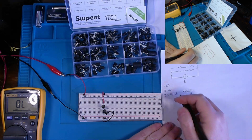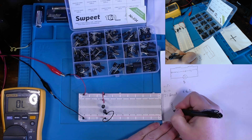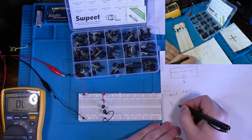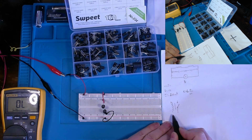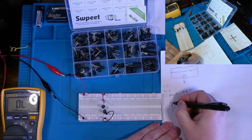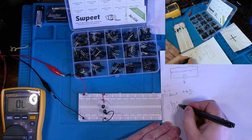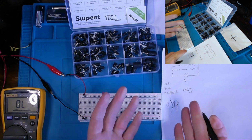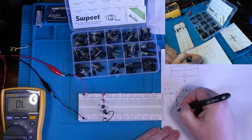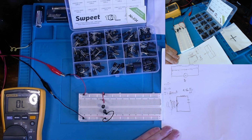Remember safety. But if you have ever seen something like a relay in a circuit, it's basically a coil, or an inductor, with essentially a latch, and as current goes through the coil portion, electromagnetic fields are created. It's these fields that pull our latch closed, which is basically what's energizing the relay, and then whatever's on the other side of the latch in circuit, say resistors, capacitors, whatever, that whole circuit over here is now closed.